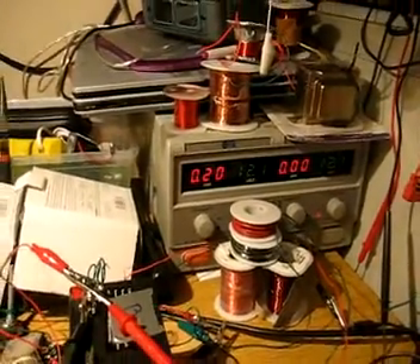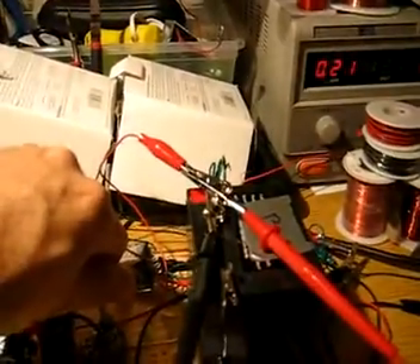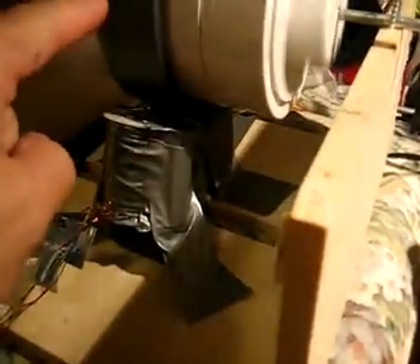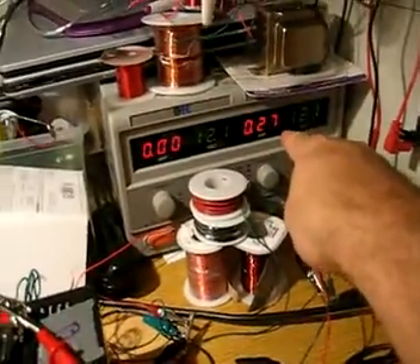Back again. It's running at 20mA and lowest speed. I'm going to turn off that one, turn it off, now connect the lamp of the 2nd system and turn on the 2nd system. Lamp is on, spinning — so this coil now is triggering the device. And you can see now it's using the 2nd amperage, 260mA and the lamp is going on, and the oscilloscope signal along the B channel is there.